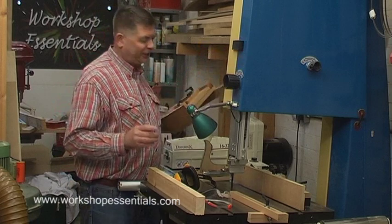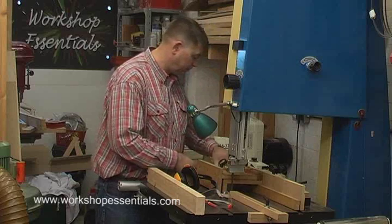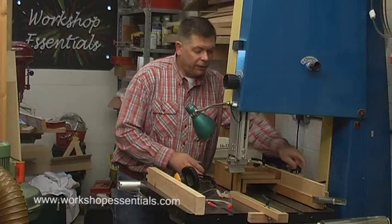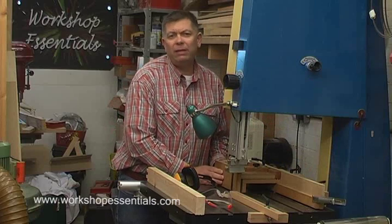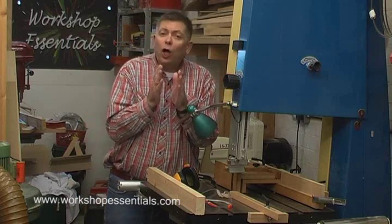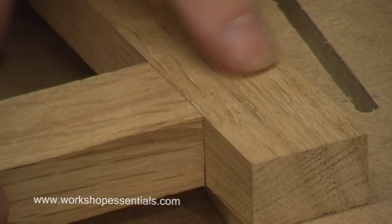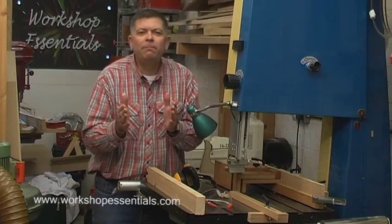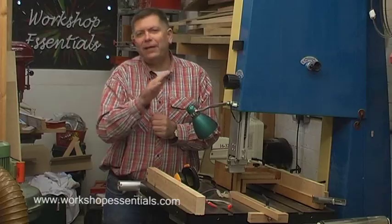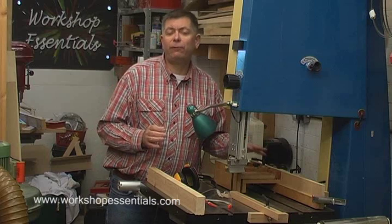This is the Ultimate Bandsaw Tenon Jig, and it clamps to my rip fence. My rip fence has fine adjustments on it, and I can alter the position of this to within 0.1mm very easily — that's the thickness of a hair. So I have perfect control over where the tenon sits within the thickness of the workpiece, and my face frames come out perfectly flush — no cleaning up to do except the glue. That saves me a great deal of time, because I don't get that annoying little step where you have to plane off the faces of all the rails on one side and the faces of all the stiles on the other side to get it perfectly flush. This gets it right first time, every time.